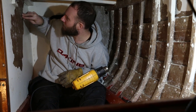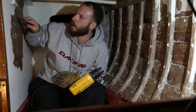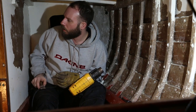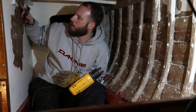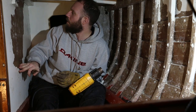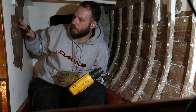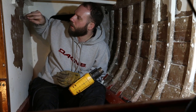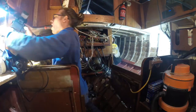It's almost silver, almost metallic, but it really doesn't come off. The white paint comes off but the primer doesn't. That's alright — we don't need to get the primer off. It could actually work in our favour because then we haven't got to re-prime. We'll put a barrier primer on, but if it's not peeling off then it's not going to come off anyway.